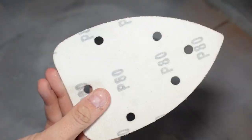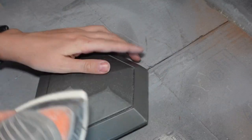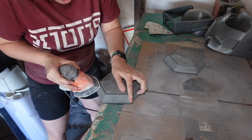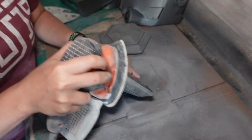The first thing I do is take my 3D print and some 80 to 120 grit sandpaper and just start sanding down those layer lines. I'm typically printing at 0.28 millimeter layer height, which works for larger things that don't need really fine detail, so I use 80 grit sandpaper to get those layer lines down. In the past couple of months, I've also been printing some things at 0.12 millimeter layer height, and with those prints I can get away with 100 to 120 grit on the first pass. If your layer lines aren't going anywhere, go with a lower grit — you could even go down to 60 or 40 grit if you really feel it needs it.